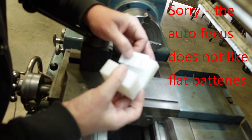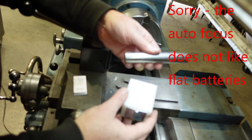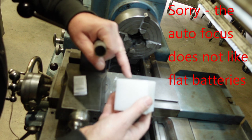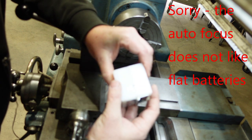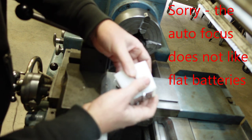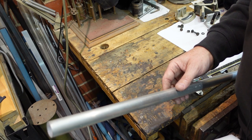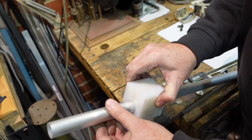To do that I want to make up a jig. I've got two pieces of plastic here which I've just hinged, and that's around about where the centre of my 25mm hole is going to be. This is a piece of stunt tubing — that's going to go there and then I can drill my 16mm diameter hole for the hole saw. To get a nice tight fit I'm going to wedge that open a little bit with a bit of business card, bore my hole, and when the card is removed it'll be a tight fit on the tube so it stops rotating.